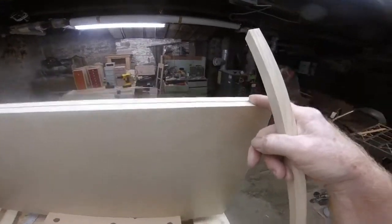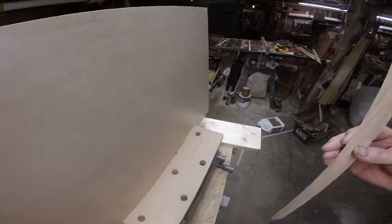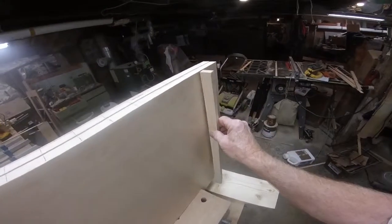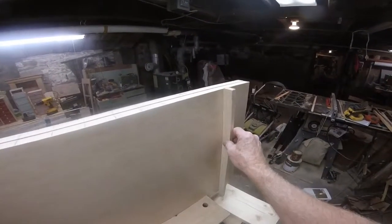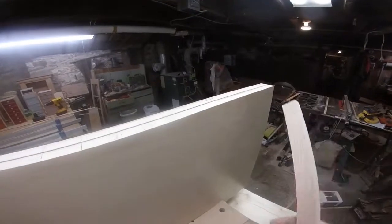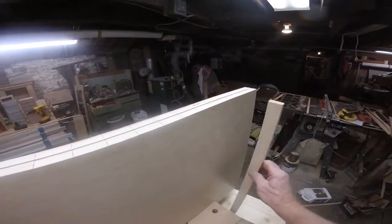And it's important to mark these. I've got them clamped together. It's important to get them exactly straight, because otherwise you could have 1/8 of an inch off on the other side, and it'll turn out to be a pretty bad job. So lock them both together, mark all your marks, and then with a square, drive your line down, and then attach it.